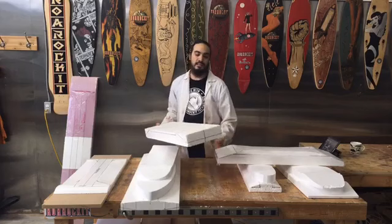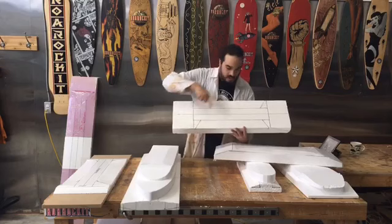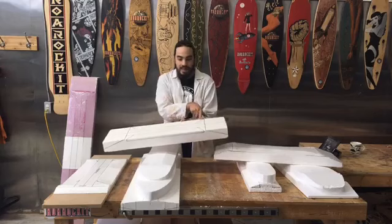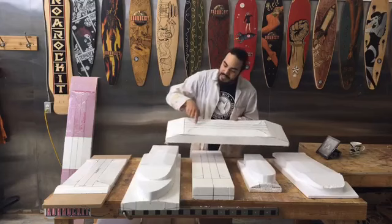You also notice here that we've terminated our curves by way of little angled lines. When we shape our board, when we carve it out, we're either gonna not pass that line, or we're gonna gradually curve it up to meet the flat at that point. This one here is similar to that. Instead, I do curved termination lines, right?